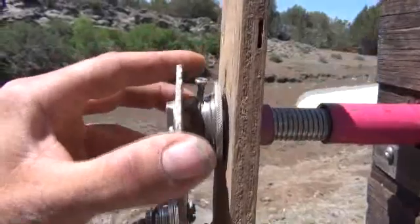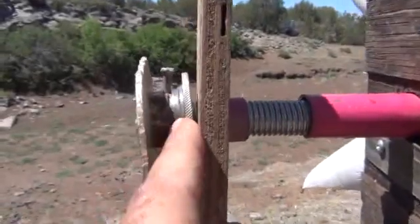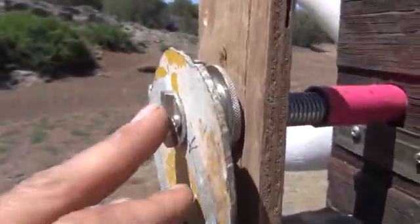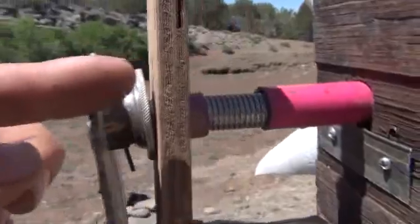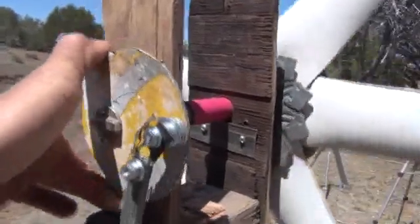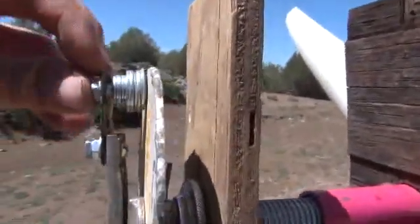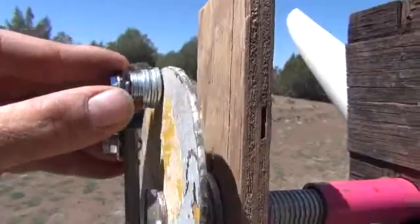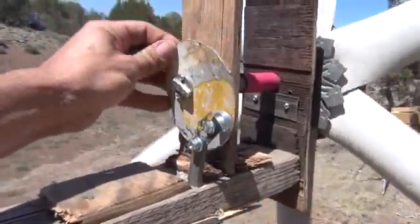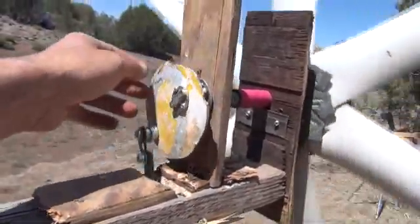Very simple design here. You can see I just have a single bicycle spoke pin. I took some brass pieces, some washers from the bicycle, I drilled all the way through the shaft and these, and I put a pin in there to lock that all on with this piece sitting right through the center of it. So that goes down through the center, pin locks it into place — just a cut out piece of aluminum here. Inside of there I have little cut out rings that stay stabilized and give you a bearing kind of surface to rotate on. It's a little flimsy at the moment but just trying to get the idea to work, and as you can see here, as it rotates it brings that cam and that piston all the way up and down like that. That's all you need to create that pump action off the back of it.